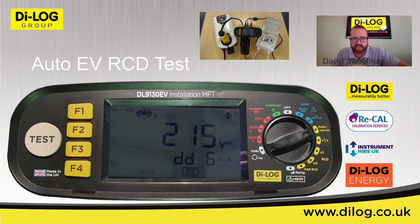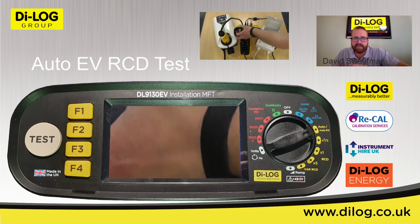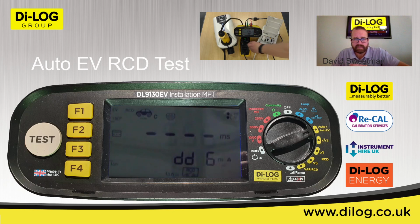Right, I'll start the sequence. This will take a little bit of time to move through, and the reason is that the EV charger takes a little while to reset once it's been tripped by the 6 milliamp RDC-DD. I've got it plugged in with the EV adapter into the EV charger, and I've pressed test. You can see on the screen it's conducting the 6 milliamp DC tests. You will also see the combination of A and C flashing next to the vehicle. That's prompting you to rotate the control pilot switch between positions A, which is non-charging, and C, which is ready to charge, and that in effect resets the EV charger each time.